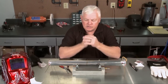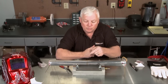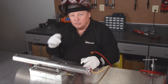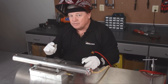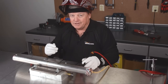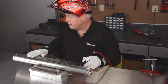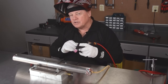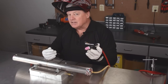The purging time on this is only going to take about 2 to 3 minutes, so I'm going to go ahead and set up, put all my safety gear on. By the time I finish, we'll be ready to weld. Now that we've got this tube purged out, we're going to weld up half of it with purging. I have a 035 diameter filler — I like the real fine stuff, but you may like one size bigger, like 045. Just know that once you get to the 062 diameter, it makes it a little rougher to weld — it tries to wander on you a little bit. I'm using a gas lens setup. My stick out is about a quarter of an inch. It's a 1/16th diameter tungsten.